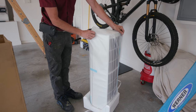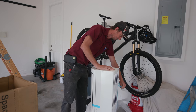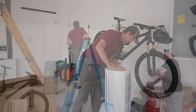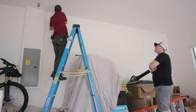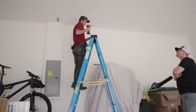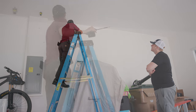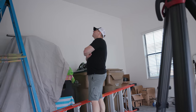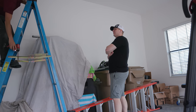It is an 18,000 BTU Mitsubishi — a nice little heat pump system that can heat and cool this area. It's good that it just kind of snaps on, a little bit more sturdy than the Carrier one. They're not heavy at all, so it never hurts to have a few extra anchors just in case. For a mini split install, you basically do a hole saw and drill a two and a half inch hole — good to go.